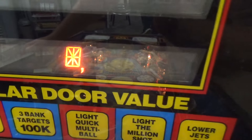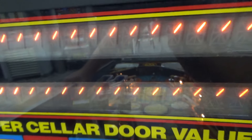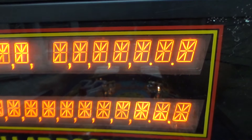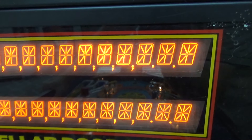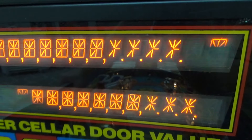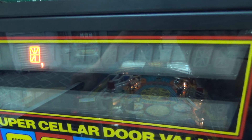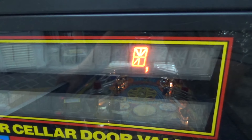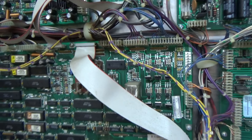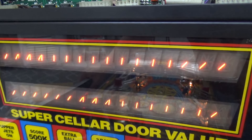We're in display test - it's just on the top display, and the bottom diagonal is missing. See it? Just on the top - the bottom's fine. So we need to look at that and see if that's a separate signal for the top and the bottom. That could be the display, or it could just be the signal to the display. Sometimes it's just a bad connection on the ribbon cable. We'll look in the schematic to see if we can track it down. Yep, just that one.